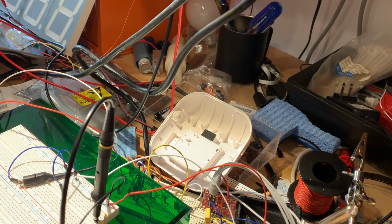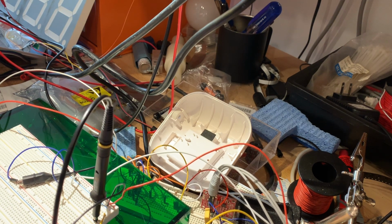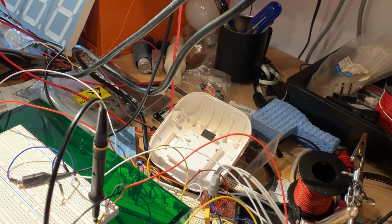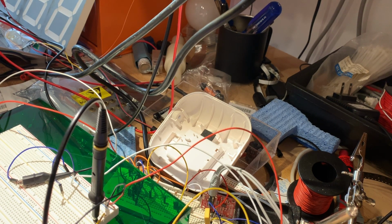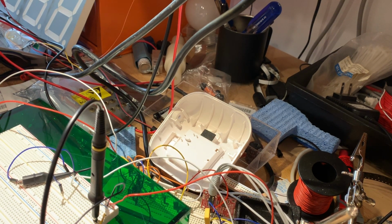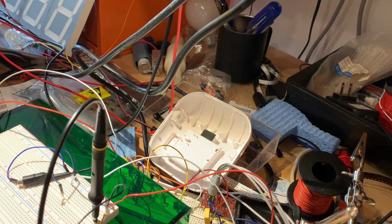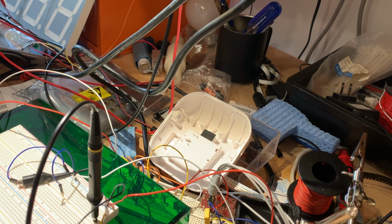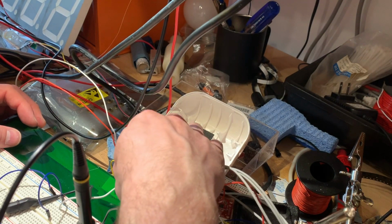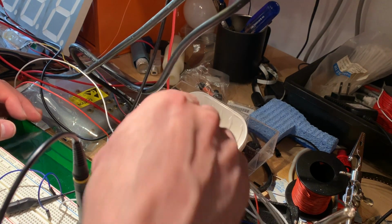Well, I didn't see anything on the output on serial. Oh. No, I thought I saw something for a second on the serial output. I didn't. Let's try tying it high with a resistor. What is a reasonable resistor value? I don't want to fry anything. There's a 100k. Yeah, tie it high via 100k. That should be good enough.